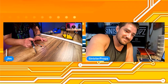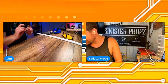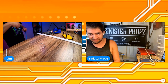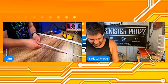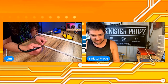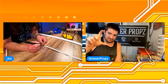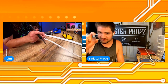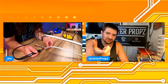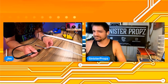So remove all four wires? Yeah, remove all the wires. I like silicone covered wires for this project because they can be curled. The insides of the Adafruit wires are very rigid and I noticed that they break off. You need wires that have some spring to them because your blade's going to be moving in there. So I use silicone-based wires, and I give them a turn, and it provides spring. You'll see when we get there.